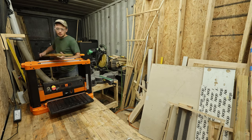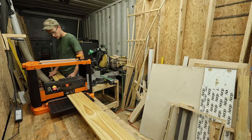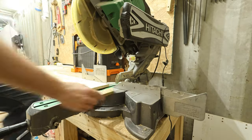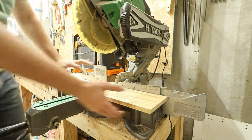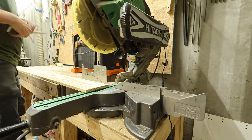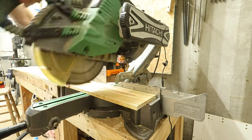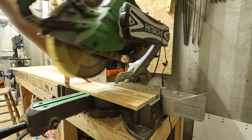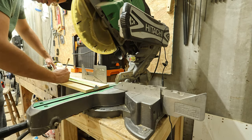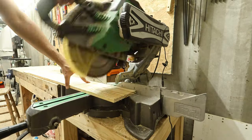Here I'm just planing the fence picket down to get the two sides smooth — they're a little furry from the store so just smoothing that out. It's a lot easier with a planer than a sander. Then we're going to square up this end and mark our pieces. We need two 11-inch pieces for the ends, a 10-inch piece for the base, and the sides are 8 inches each. There will be a set of plans up on my website if you want to download those.